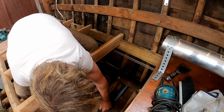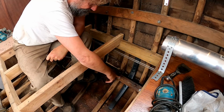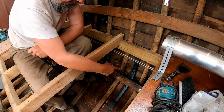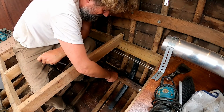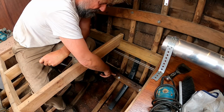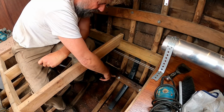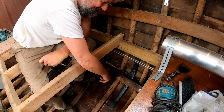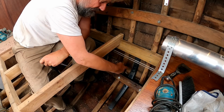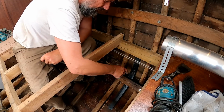You probably also noticed I put two 1/4-inch lag bolts in here, right through to the outer chine log. Well, there's an intermediate chine log, but anyway, to strengthen it up, basically to replace these old galvanized, or not galvanized, but rusting carriage bolts, which are the main structure to hold this sandwich together. And of course, I don't trust any bolts on the boat, right? So I'm going to try and get these out at some time, but because they're carriage, I'll never get the heads off until I take the outer chine log out. Never mind all that. Extra bolts with new galvanized.